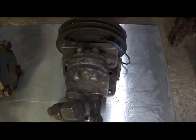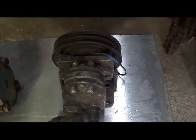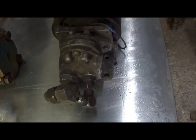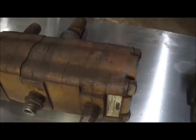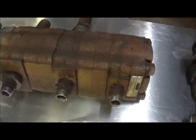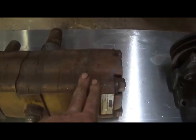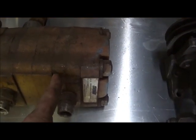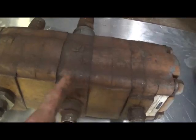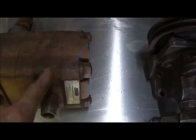This is a gear pump also. This particular pump is actually too small — not enough gallons per minute — so I'm not using it; it's just one I've had for quite a while. That belt-driven approach is what we plan to go with. This pump here is actually a triple pump — it's one pump but it's really three separate small pumps. These three different pumps each put out a different gallon per minute. The easiest way to see that is the thickness of each section: this one is way more gallons per minute than this one, and then it's more than this one because it gets narrower.